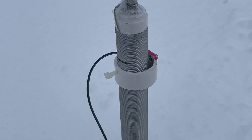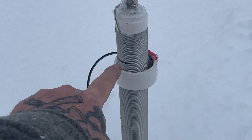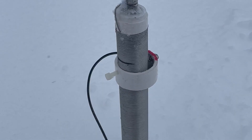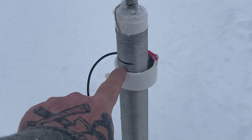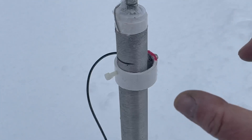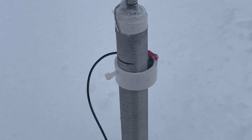Here's what I wanted you to see: there's our black line for 40 meters from yesterday, and the red line is over here. We have dropped that thing five or six coils and then fine-tuned it to get to the SWR we needed today compared to yesterday. The only real difference is atmospheric conditions and ground substrate with this six to eight inches of snow on the ground. That's important to understand as well.